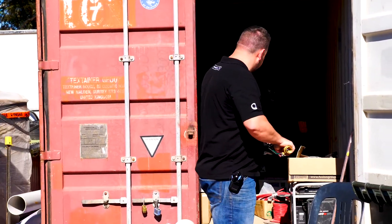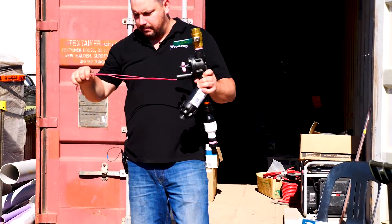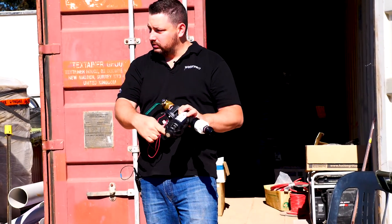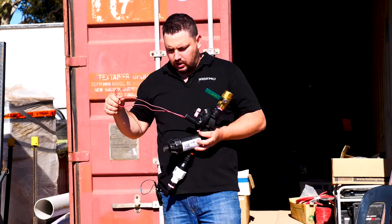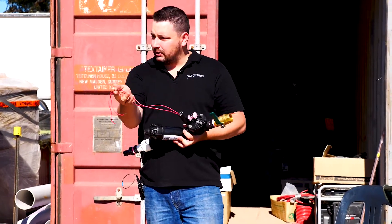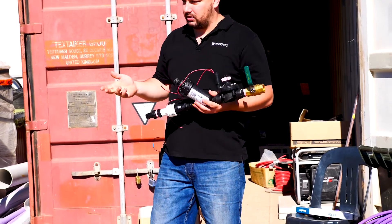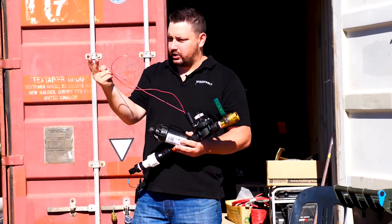From a control wiring point of view — this is an AC controller on a wall. These coil wires are both red, which indicates it's an AC coil. Other valves might be black and white — that still indicates an AC coil. Because it's alternating current, it doesn't matter which way you have the wires. Hunter Node battery-operated units will be black and red, which means they follow polarity — positive and negative — so red to red and black to black. With AC coils, it doesn't matter: any colour wire to either terminal, and the other wire goes to common.